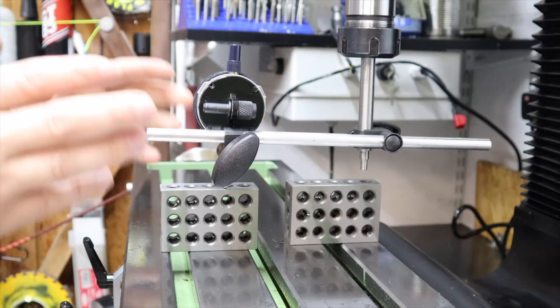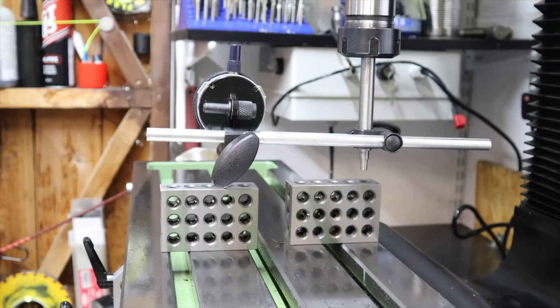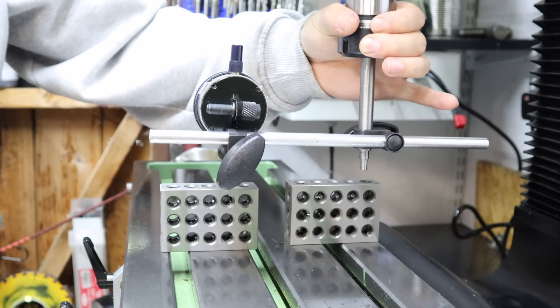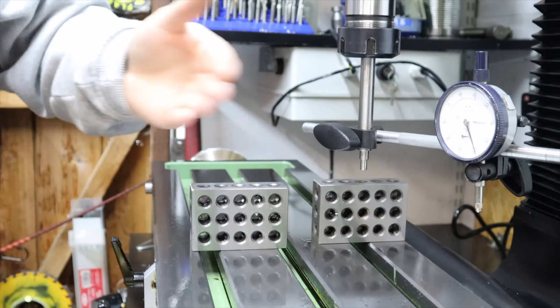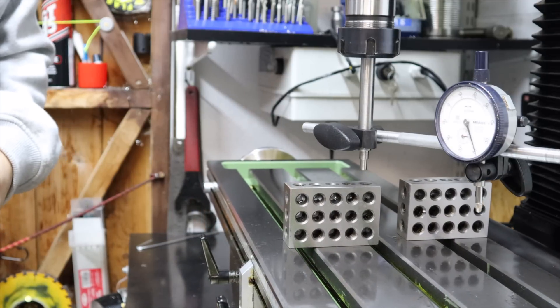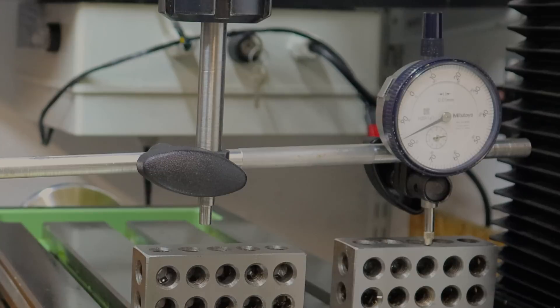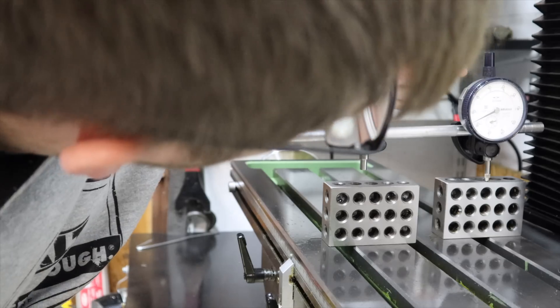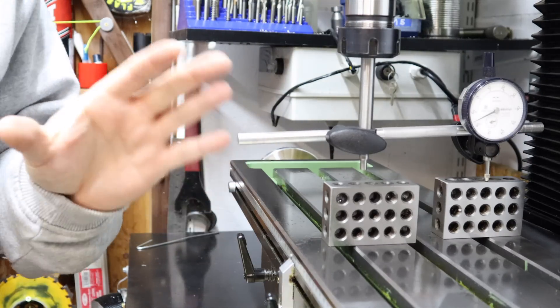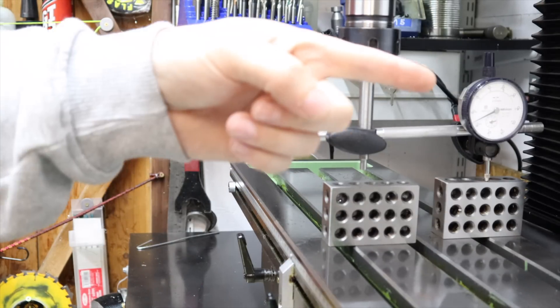The nod is something I'm really interested in because as you saw in the previous video, my old milling machine's nod was quite a bit out. I've set the DTI gauge to zero and I'm moving the carriage along to get the full travel. The initial reading is showing 0.15mm out - which sounds a lot, but I haven't fully tightened down the column yet. I need to work out which side is high and which is low, do some tightening on the column, and then recheck.